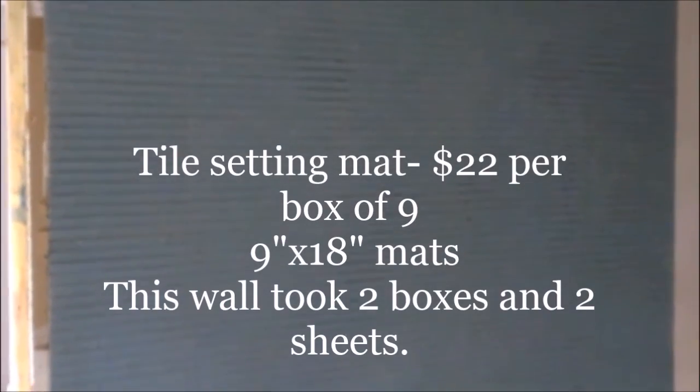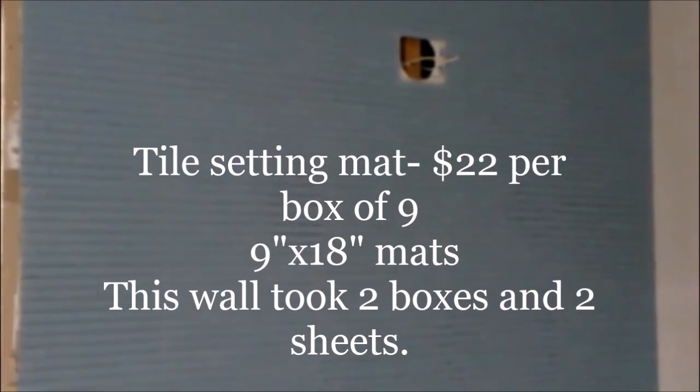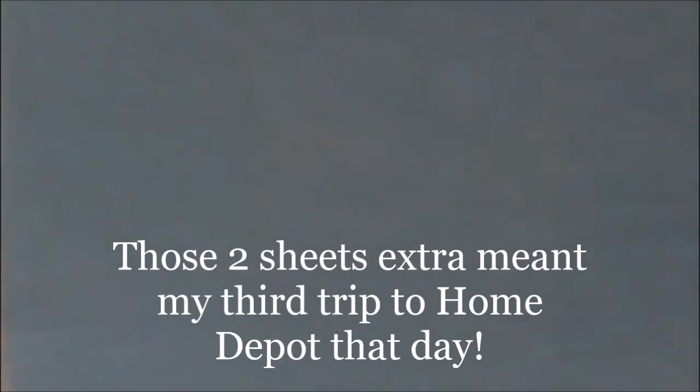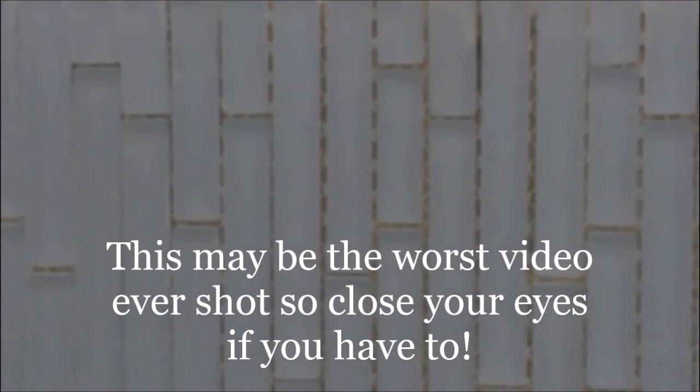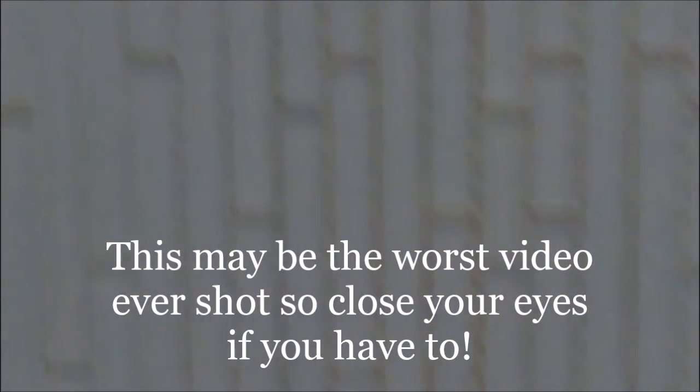I just got finished putting up the glass tile in the master bathroom. I used that cool sticky sheet product to put the tile up, and it looks really beautiful. There are a few things about glass tiles that are tricky though. Glass tiles are sharp because they're glass, so when you're using your wet saw, you really should cover all the way up with long sleeves and something to protect your neck. I didn't, so I have lots of little bloody spots on my arms.